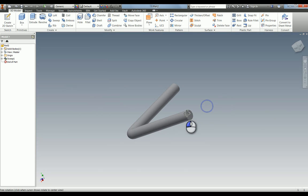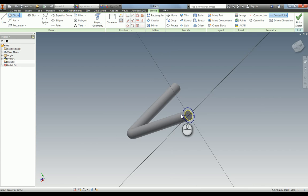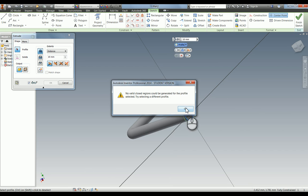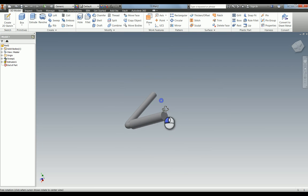Now we need to add in the 6mm ends — this is 6mm on the edges and only 4mm around the bend. I'm going to do a circle on that point just in the middle, and that is 28.5mm. I'm going to extend that down to there and do exactly the same on the other side.